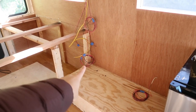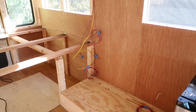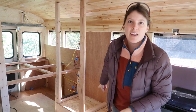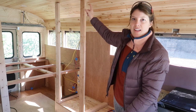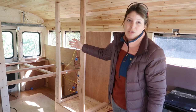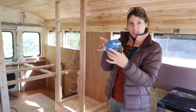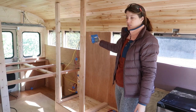The idea is to build walls to cover up this window and go all the way to the ceiling to build a nice little closet. So this wasn't too bad — I've got two bottom plates, bottom framing pieces that run along the bottom of the closet, and then two upright vertical pieces. I'm using two by fours just because that's what we have on hand, though you could also use two by threes to save a little space. We're using two by fours specifically because we're putting outlets in these walls, and the outlet box depth matches the depth of the two by four, which allows the outlet box to sit into and attach to it.